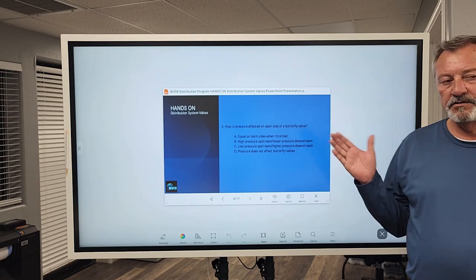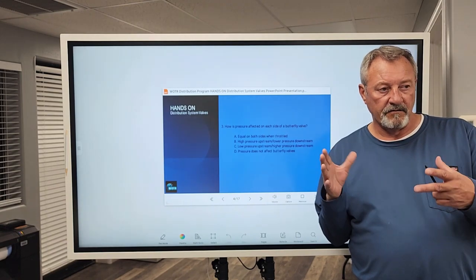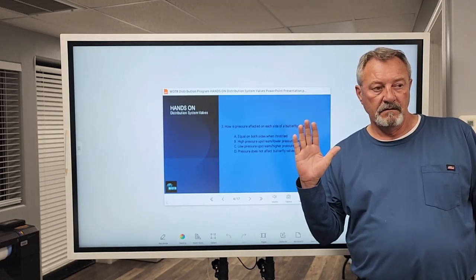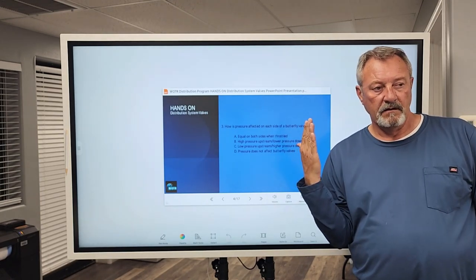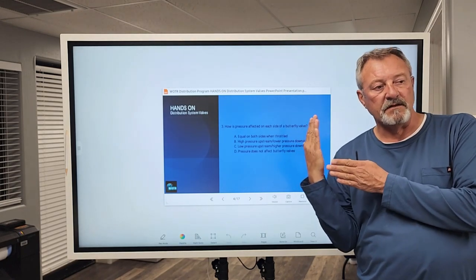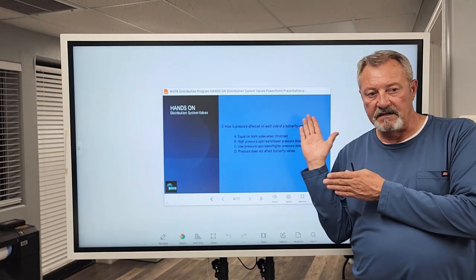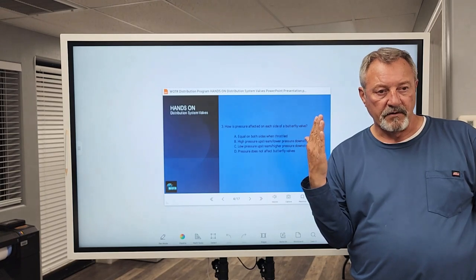So because the closure element is on an axis right through the center of the valve body, it still remains in the flow. So when the valve is closed, it stops the flow. When the valve is open, its profile is to the upstream. The water coming past it has to push back. So it's causing back pressure. There's friction loss there. Anything that's in the pipe blocking any amount of water from flowing nice and smoothly down the pipe causes back pressure. So the butterfly valve causes back pressure.